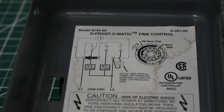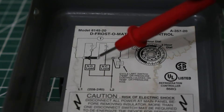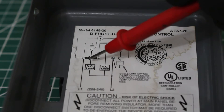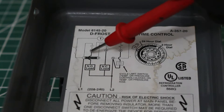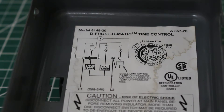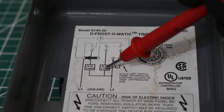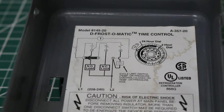With the example we're using, once we're in defrost that electrical heater is going to be energized for 20 minutes. After 20 minutes, again we're going to have a shift of contacts - the normally open load which was closed during defrost will open, shutting off the defrost heater. Then our compressor or condensing unit will start again, and it just repeats that process.